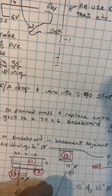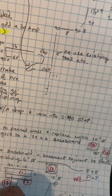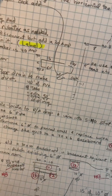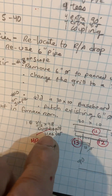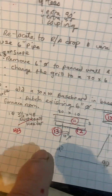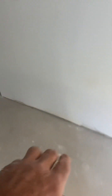He wanted the 10-inch round cut into the left side of the box, not center. Sorry — I reversed that — to the right side... no, I'm right: to the left side. Get the pipe all the way back. On the other side of the wall, I'll give you a header for that. We're going to put a 30 by 10 baseboard grill in the family room here.